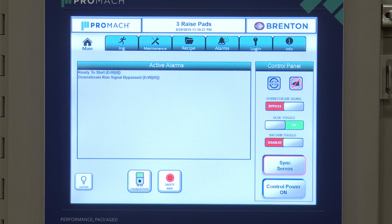This next button is our sync servo button. This is a really useful feature because it allows all our servos to move to their correct position based on the servo position without actually starting the cell. Anytime you hit start it will also do a sync, but this lets you do it without starting the cell.